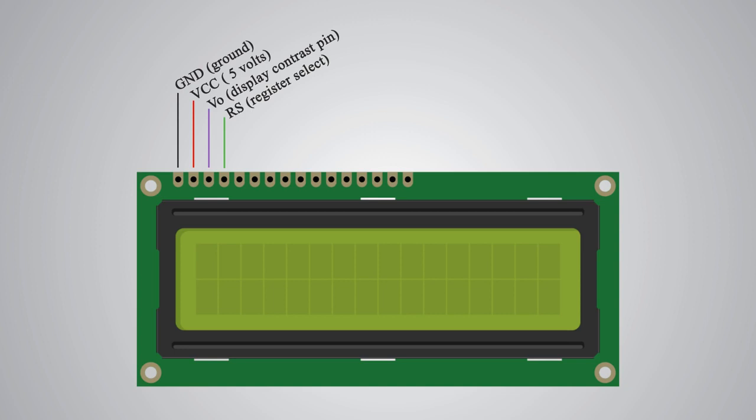like set the cursor to a specific location, clear the display, turn off the display and so on. And if the RS pin is set on a high state or 5V then we are sending data or characters to the LCD. Next comes the RW pin which selects the mode whether we will read or write to the LCD. The write mode is used for writing or sending commands and data to the LCD. The read mode is used by the LCD itself when executing the program, which we don't need to discuss in this tutorial.